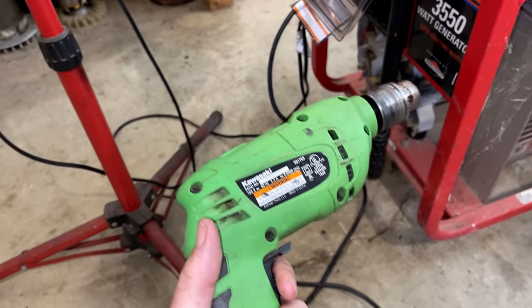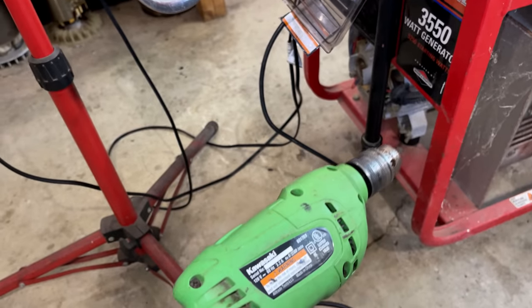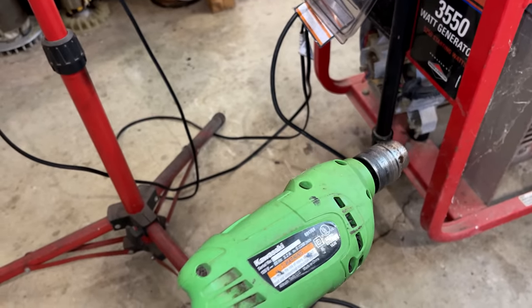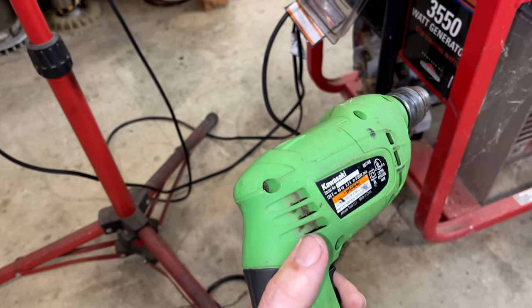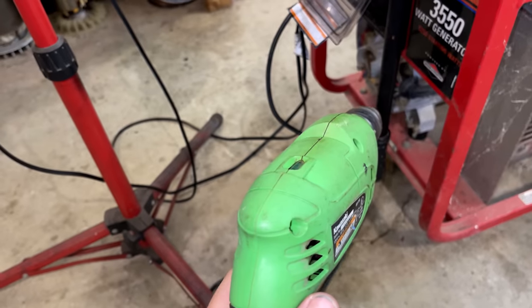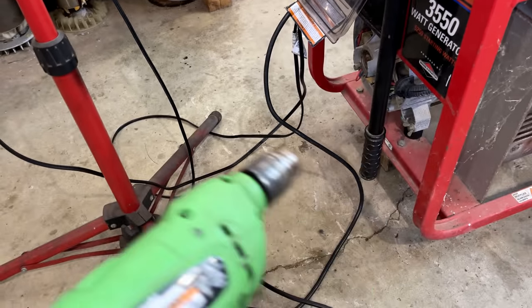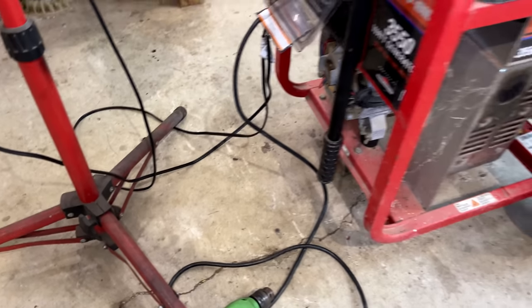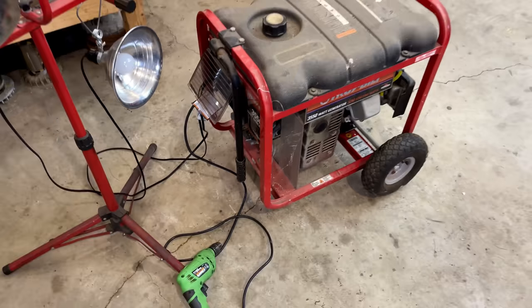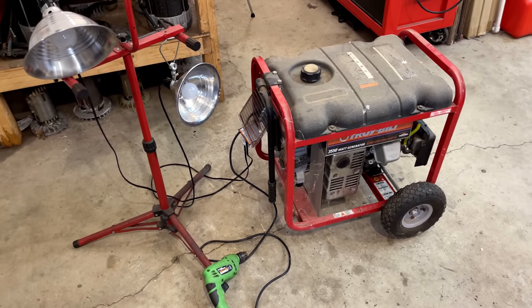This acts as a generator, and it sends some voltage into the stator, which helps excite the system. By sending some power in there, you're creating magnetic fields, and a lot of times that can be enough to give things a kickstart and get that bridge rectifier powered up to power the rotor, and then we'll quickly ramp up to full power. So let's give it a try.